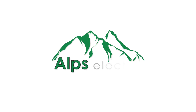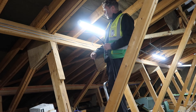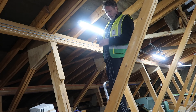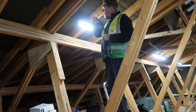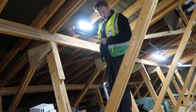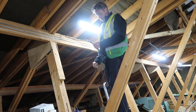This is where our inverter is going to go. What we're going to do now is get these DC cables out onto the west roof so we can start putting the panels on and getting them connected in. We've got two strings, so four DC cables. Leo's going to pull them through.